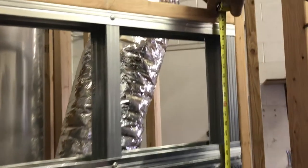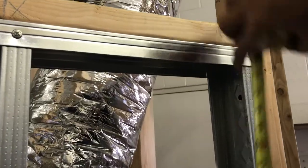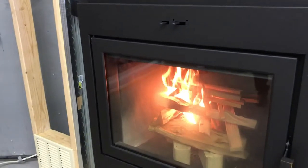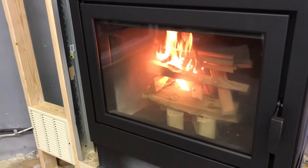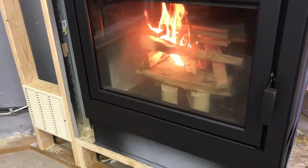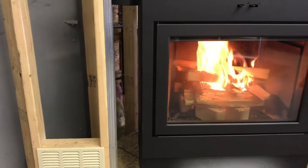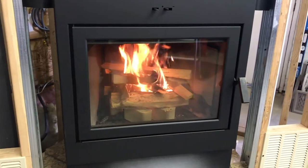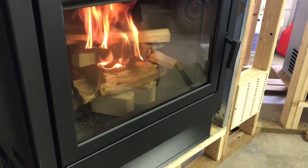This fireplace requires metal studs — the minimum is 56 by 40 inches wide. Within the metal studs you also have the requirement of non-combustible materials such as cement board, tile, or brick. It has to be non-combustible.